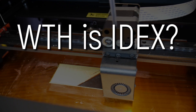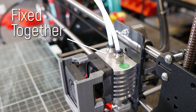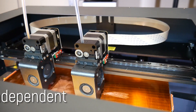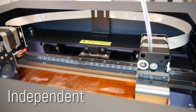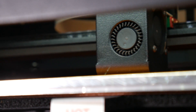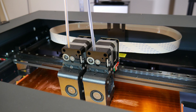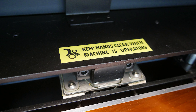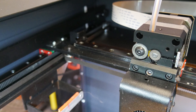What the heck is IDEX? Well, it stands for Independent Dual Extruders. So unlike two extruders being fixed together, like many other dual extruder machines on the market today, these are able to move independently to each other along the x-axis. The way the engineers at CraftUnique accomplished this is incredibly clever, and it works really well. Accuracy is further improved through the use of linear rails, as opposed to linear rods like we saw on the CraftBot Plus, and a single-piece aluminium plate which holds all the motion components for the x and y movement.